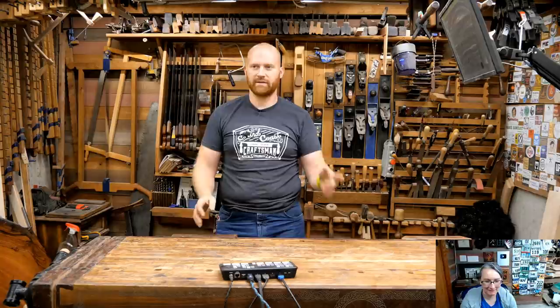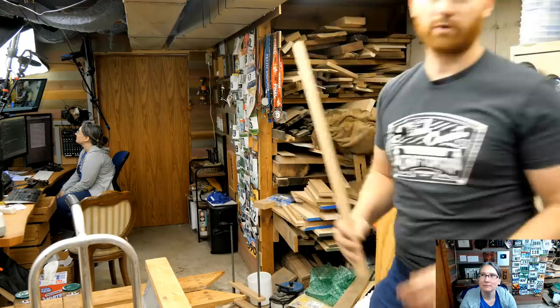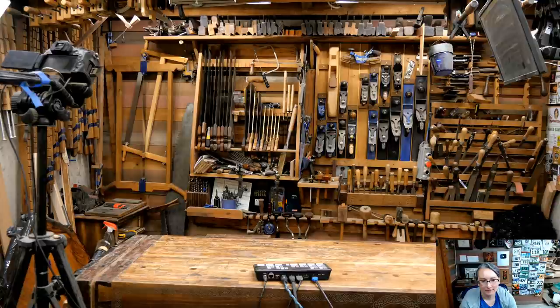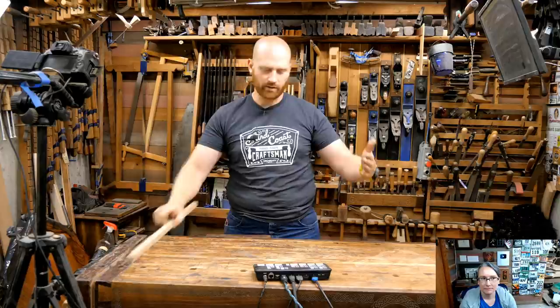And the best answer is stickers. Here, maybe you should go grab one of my stickers. Not one of these stickers. We don't need those, but mine are over here. So I've got this, which is a 3/4 by 3/4 inch stick. And this is what is called a sticker. Most of the time it's about 3/4 by 3/4. You get a few of these and you put them on the surface where you're going to store your wood, like 2 foot apart or so, depending upon the size of the wood. And you put your wood on top of that.